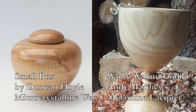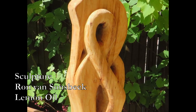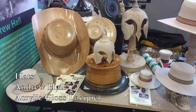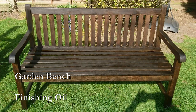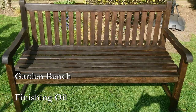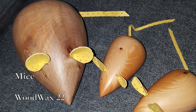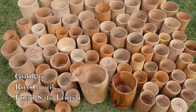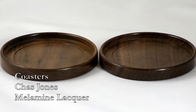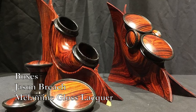For example, is the item you're making quite small and you can get away with a very glossy finish on it, or is it something larger where you want a more subtle finish that doesn't overpower the timber? Does it need to be hard wearing and at the same time does it need to be handleable as well? Could it be used outdoors? Does it need to stand up to the elements a little bit? Is it going to be used in contact with food or does it need to be toy safe? Are children going to be using it? And that's not just for toys — that's also things like nursery furniture. Does the finish need to be water resistant and or possibly heat resistant at the same time? And sometimes it can just be a very awkward shape to finish, and that can also affect your choice.